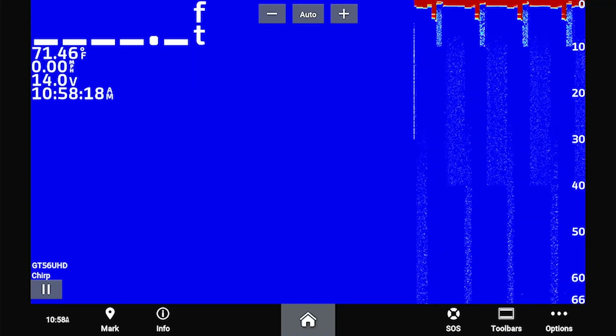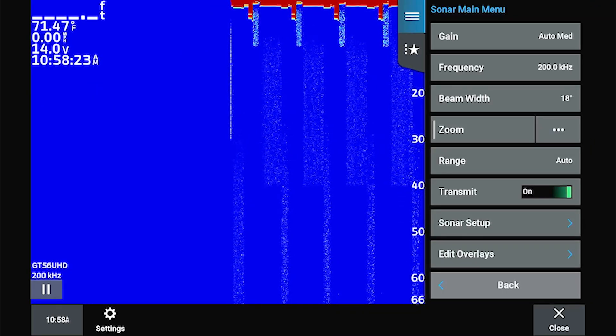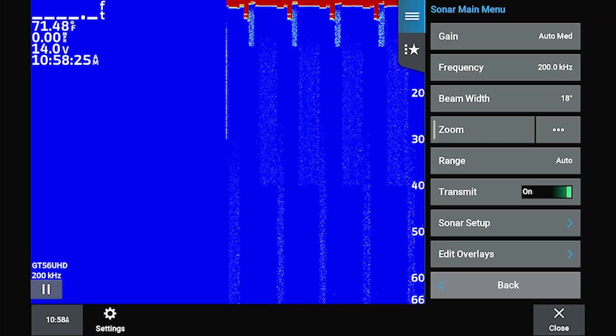Aside from physical issues, having an incorrect frequency selected or a transducer not optimal for your location may be causing issues acquiring a depth reading. The basic rule of thumb is that higher frequencies are better for shallower water, with lower frequencies being better for deeper water. For instance, a low-band CHIRP transducer will likely have issues reading a bottom number in five or six feet of water — move to deeper water for better results. If you have a dual-beam or dual-frequency transducer, pick the higher frequency when having issues acquiring depth in shallow water.